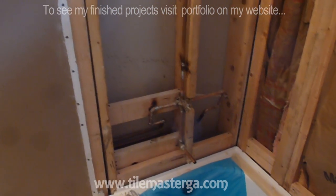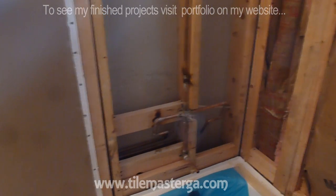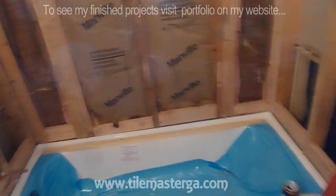But if you're using cement board, on top of the cement board I'm always applying a waterproofing membrane. Here I'm going to do waterproofing as well, but I will show you this a little bit later during this clip.